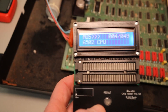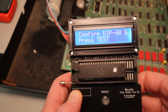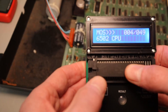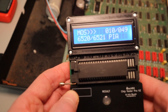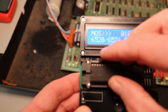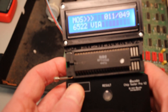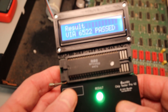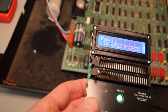Evie from backbit.io sent over a chip tester pro, with which I was able to test all the socketed ICs on the board for potential problems. The chip tester is a great tool — just pop an IC in the socket, select the correct IC type from the menu and press the test button. With this tool I was able to determine that the 6502 CPU, the 6522 VIA and the 6520 PIA were all working fine. I didn't have to test any of the RAM or ROM chips as I was using a PET RAM ROM board that bypasses them. Evie, thank you — everyone check it out, link in the description.